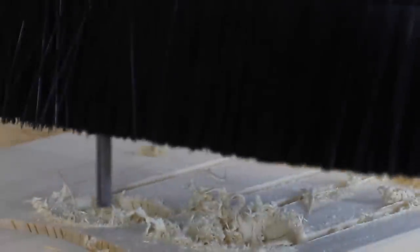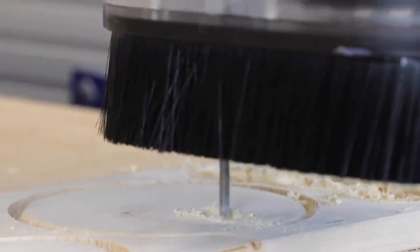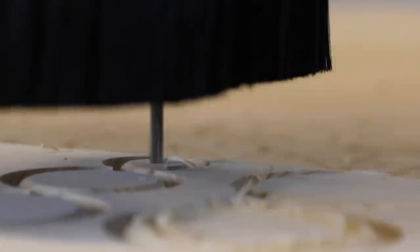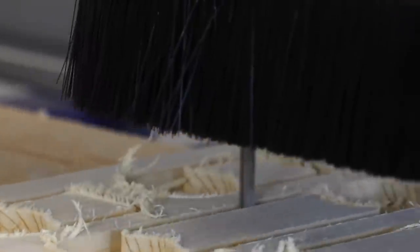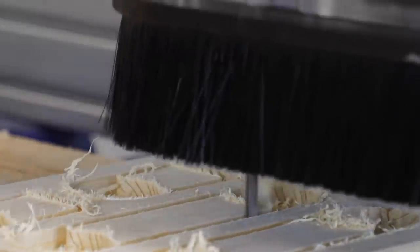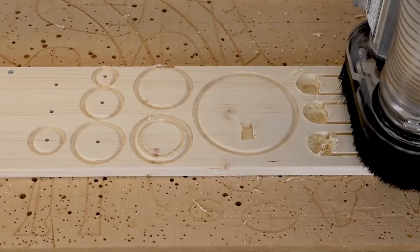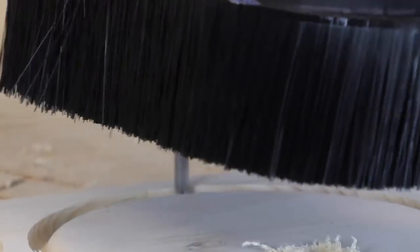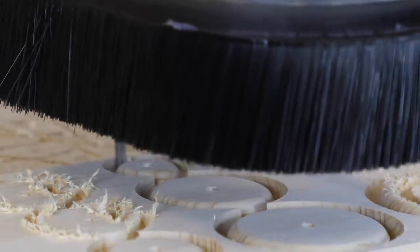We're going to go ahead now and pocket out around the armatures, which is quite nice. Worked out really well, but the fuzzies were everywhere. So, here's pocketing out in the base for the armature to stick into. Putting in the dowel holes, you didn't see the actual lip cut that we talked about. It didn't show up. But here we are anyway, going along and cutting out the profiles around the outside so we could remove the parts easily.